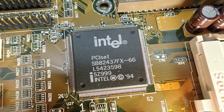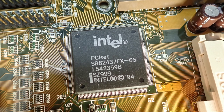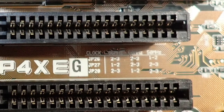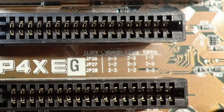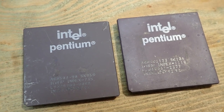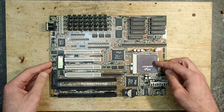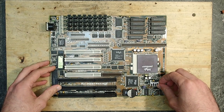It was made in the time before Pentium MMX was released, and so it officially supports only non-MMX Pentium 1 CPUs with frontside bus of 50, 60 and 66 MHz and a core speed of up to 200 MHz. The pre-MMX CPUs needed a single CPU voltage of 3.3 volt, which was not provided by the AT power supply, so the big cooler with a voltage regulator is located down here on the mainboard.